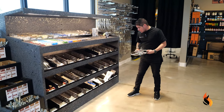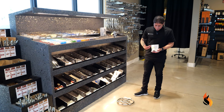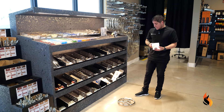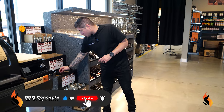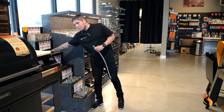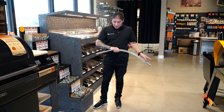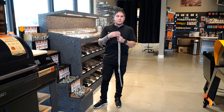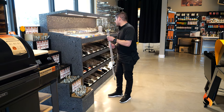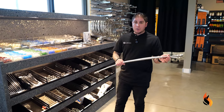Next is the key valve. These are some of the most popular options — there are different ways of controlling the flow on and off. When the valve is shut, it's shut; you don't have to worry about the propane tank or natural gas. This is just one of the ways to do it — you can hard pipe or use what we call flex lines. These are stainless steel flex lines — flexible gas lines that you can bend, twist, and manipulate to get to your valve wherever you need. I have right now a 24-inch and a 36-inch.